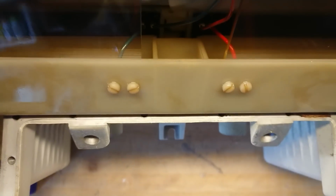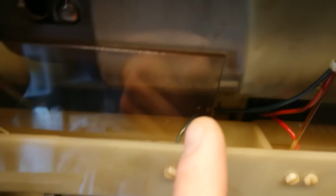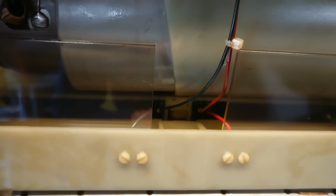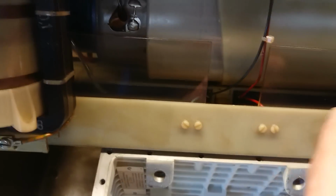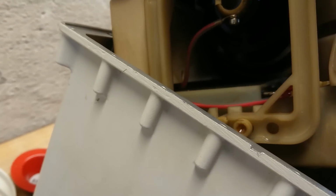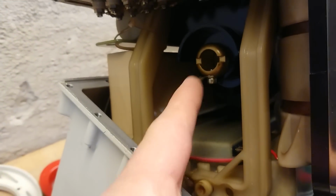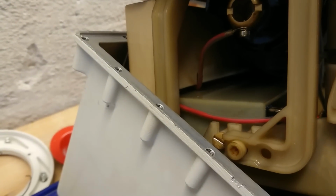These are center taps, so we get two step-ups, full wave DC, and then these are fed into the blocks you can see underneath here, which are high voltage multipliers. Now there is one there and one here, so those are also center tapped, but that's not enough. There's also, it might be a filament transformer that we have over here at the back, which we see connect up to here. Or maybe that's an additional multiplier, I'm not quite sure.